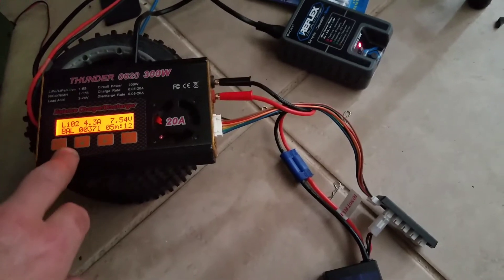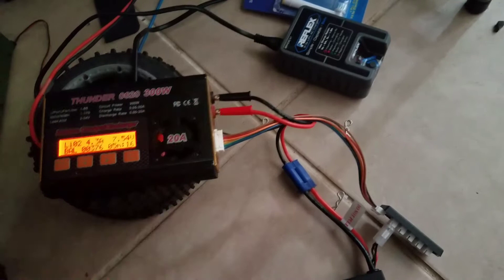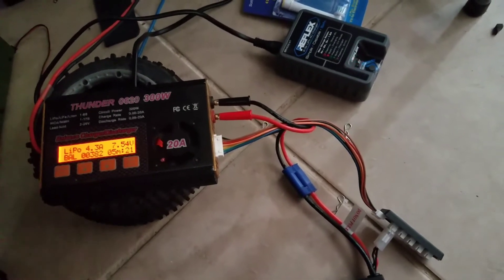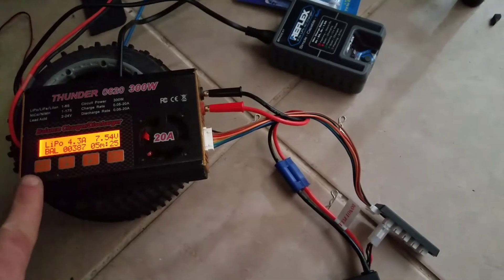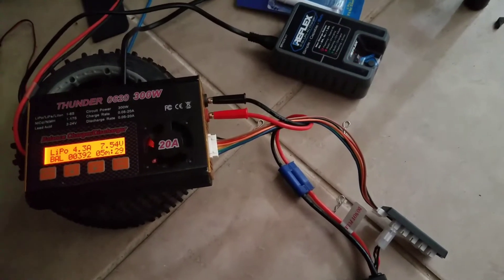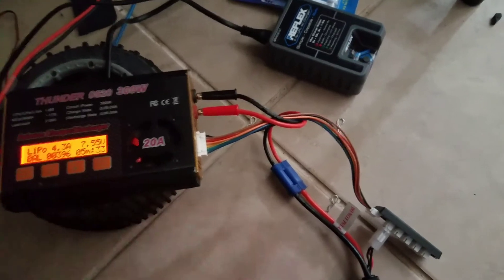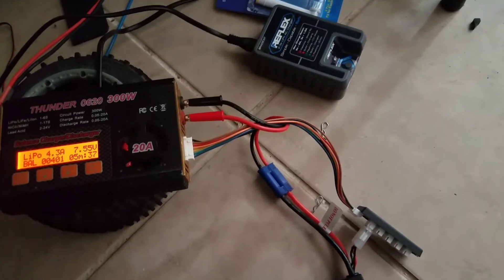I put it on two amps for a 5,000mAh battery — two amps on the nickel metal setting. Because if you do it on the LiPo setting, the alarm will go off saying there's low voltage and it's not going to work. So you've got to fool the charger into thinking it's a nickel metal battery. You go to nickel metal manual on this or any other charger, plug it in at two amps, and it starts pumping voltage into the battery. Once it goes up to a certain voltage — for a two-cell battery, once it's around six volts, about three volts per cell — I stop it and then plug it in for LiPo balance charge. That's it.